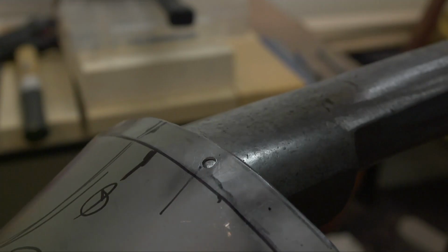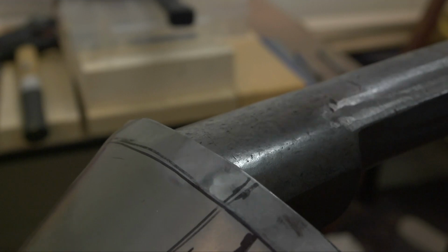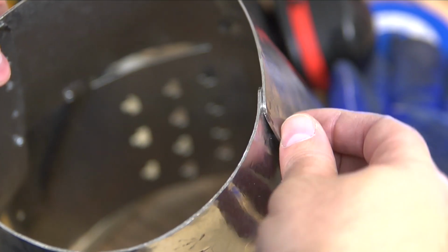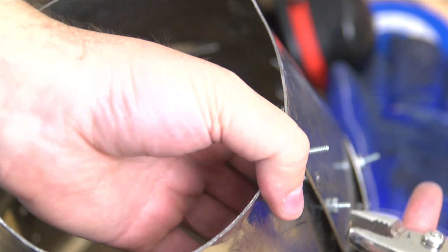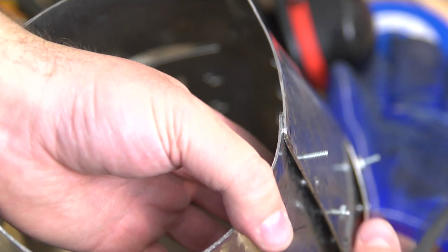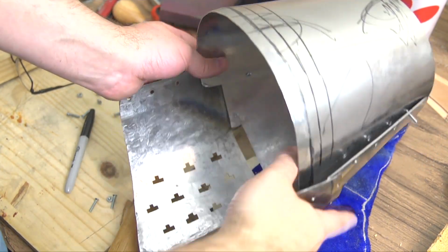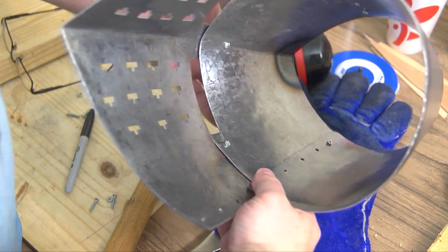Once you begin drilling holes for rivets, I find that it's necessary to be constantly screwing and unscrewing the piece. You make a few changes, bring the pieces together, tighten the screws, and then undo the screws to make more changes, and on and on. It can get pretty annoying, but patience does pay off. The incremental changes, even though they're difficult to see, eventually do make everything start to fit together.